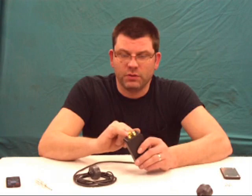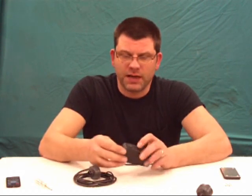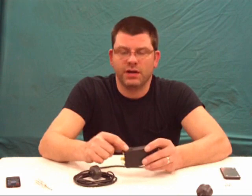Then what you do is you drill 1/4 inch holes, evenly spaced apart, so when you plug your audio cables in and your video cable that they don't run into each other. Mount those in the box, and then figure out a way. You don't have to use this type of toggle. This is a rectangular on and off switch, just a white dot.